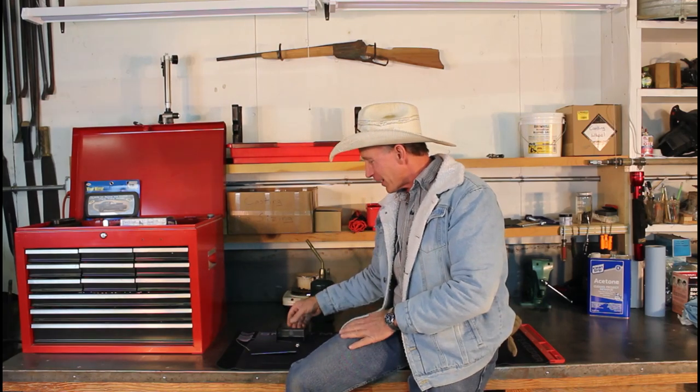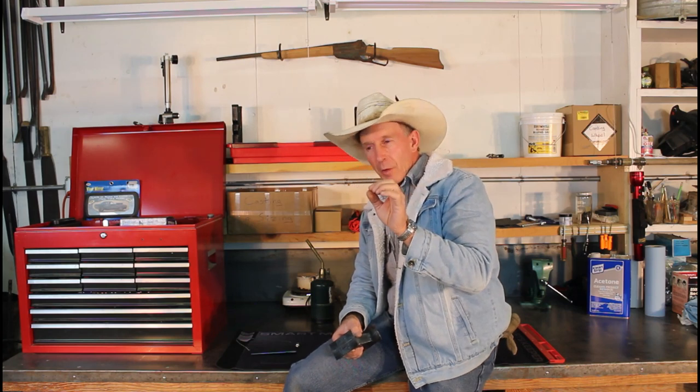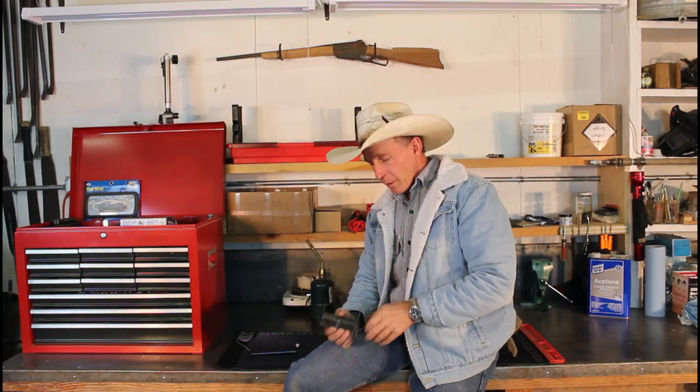As we're going through these other courses all throughout the term, we're doing some TIG welding for gunsmiths. Gas tungsten arc welding is the official term for it, but we just call it TIG. TIG welding is a very high temperature, very focused arc through a really thin electrode — most of the time a sixteenth of an inch electrode, and sometimes when we're doing really fine stuff, a forty-thousandths electrode.